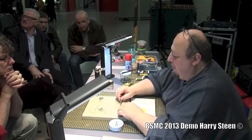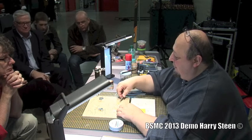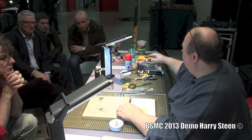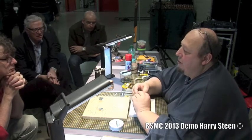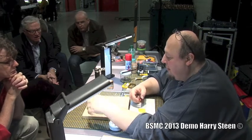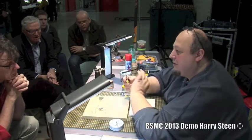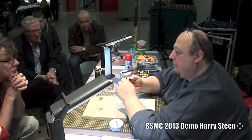So this is basically what I would like to do — I would like to solder them together. The trouble with wires, especially the smaller they get, is sometimes they have a coating. This wire here is coated and that will not work, so you have to sand the coat off. I had to sand it a little bit to get the lacquer off. Then I can solder it in position.